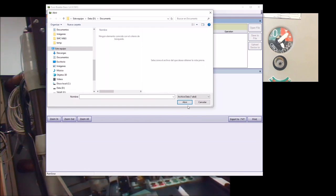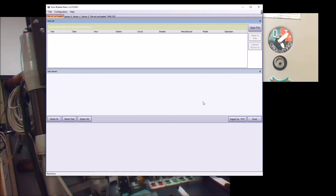Yeah, in fairness, this is what we do, and I actually did that, and I was able to see that with your units, we then injected 100 amps, got the same readings, and we were very happy. That means that the unit you presented there is doing a great job, to be honest. And in terms of saving time on site, that's very useful, because you get to do two tests in one go with a single device, and that's a very good thing. We always double check it, just to make sure that we have the right reading regarding the contact resistance. And I guess that's the only way, isn't it?